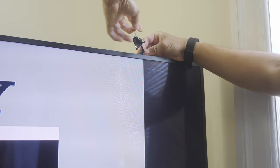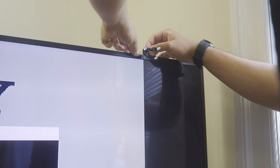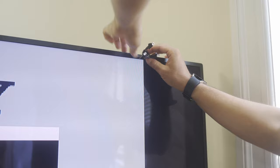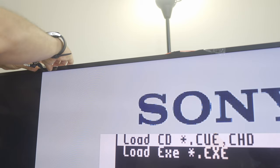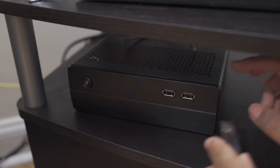Now it's time to put these emitters on my television and configure the MiSTer to play some light gun games. Place the emitters on top of your television on the corners of the 4:3 screen space that games appear on. I'm using tape so they stay put. Make sure the emitters are facing straight ahead. The emitters can work further apart, but that means you'll have to stand further away so the GunCon can properly see them. My TV is 60 inches and I had to be a minimum of around six feet back for the emitters to work best.